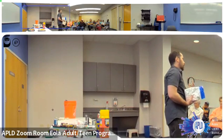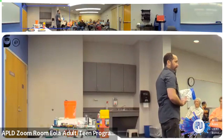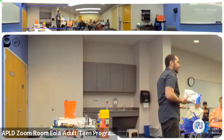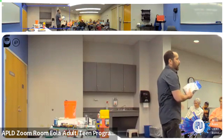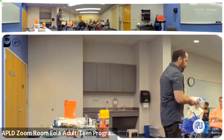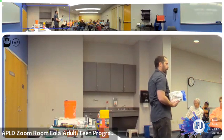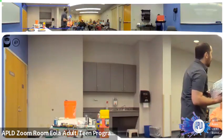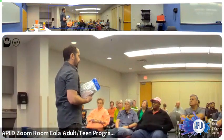I don't like that stuff. I don't like that stuff for a couple of reasons. One, once you buy it, you've got to use it, man. So, like, line up all your little dings and dents in your house and figure them out if you're going to bother to buy. Even a small bucket goes kind of a long way. It's pretty expensive, okay? And it tends to be a little thick, so you end up mixing it with just a little bit of water anyways, okay? Another thing I don't like about that is you still have to wait usually 24 hours to put that second coat on, okay? And especially for an amateur, when it comes to drywall repair, you're usually looking at like three coats, the minimum, before you want to try and sand, prime, and paint, okay?